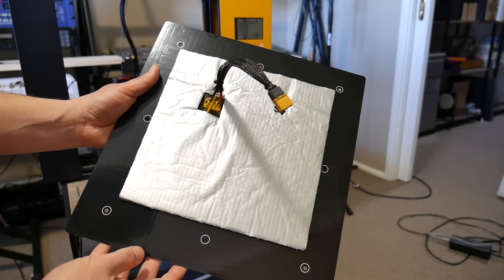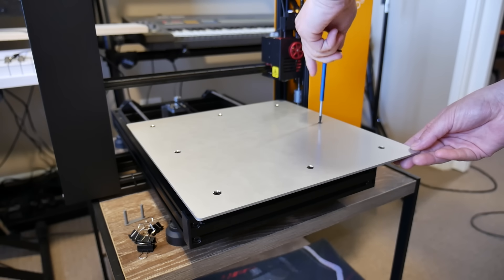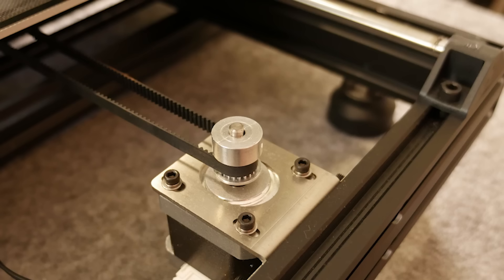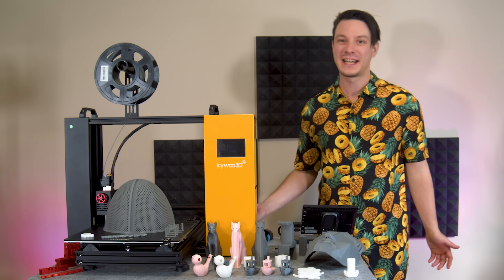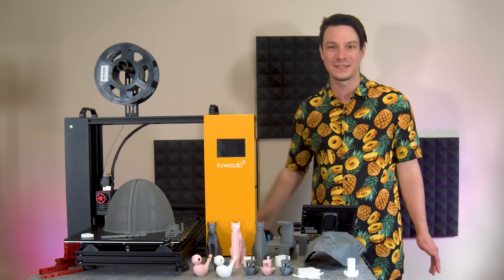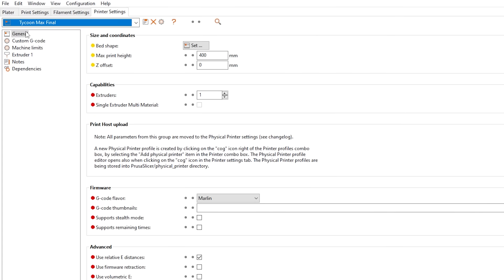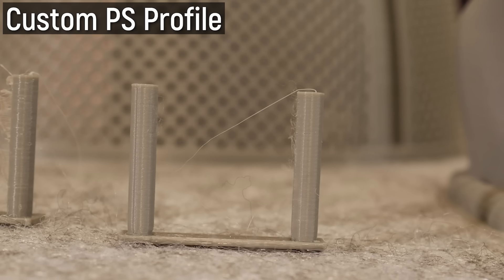The plastic offsets underneath the bed appear slightly deformed, so they might not be up to the task of holding it at high temperatures. I tightened everything back down in a cross pattern and ran mesh bed leveling again, but this tiny additional tightness means one screw in the back now collides with the shaft of the Y-axis stepper motor — annoying. The prints I was getting were okay but certainly not great. I tried Cura with suggested settings and completely custom settings, but nothing was working, so I built a PrusaSlicer profile from the ground up and started to get decent prints. Link in the description if you want to download that.